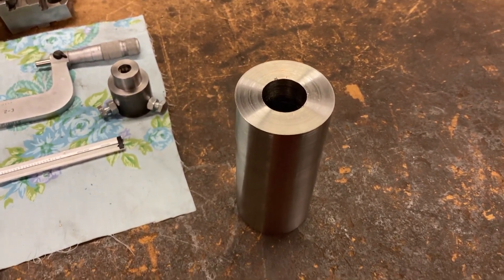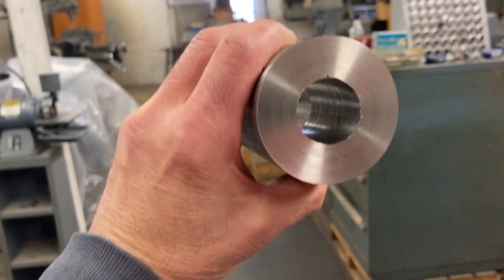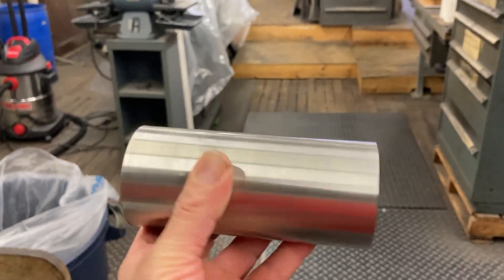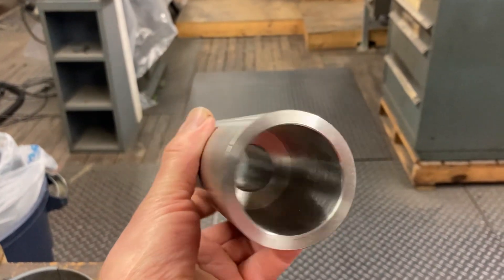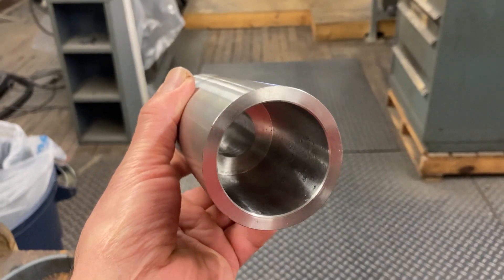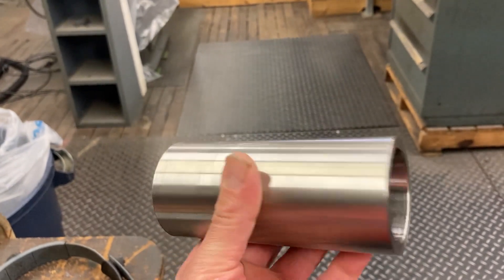Here's the drill-through. I already rough bored the other side. The part's too long — I can't do it all at once. I do have a finish bar long enough to finish bore through, but not for roughing. So I've got a heavy duty bar choked up just around a little over three inches. This thing's going to finish at five and a half inches long; they're about six inches now.